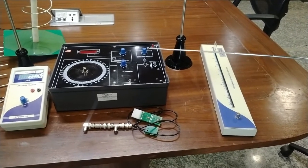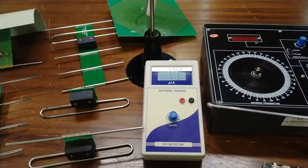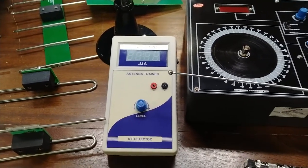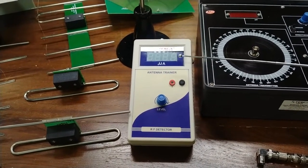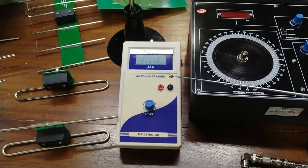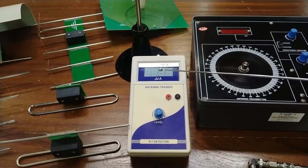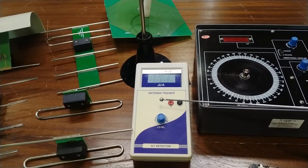This is the complete setup of the main unit. Now we are going to describe the receiving end and receiving unit. We are also offering an RF detector or receiving unit. This is a completely passive instrument. It can be installed separately and works on a plus 9-volt battery inside. A DPM digital panel meter is given on the front panel, which you can use in microampere ratings to check the readings. The RF detector consists of a folded dipole antenna as the receiving element and a reflector to reduce possible disturbance to measurement due to reflection of waves.